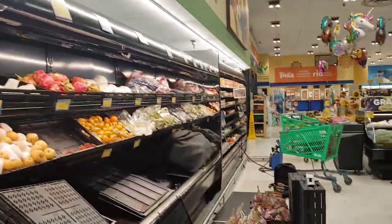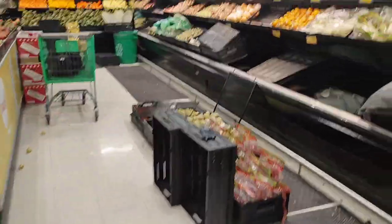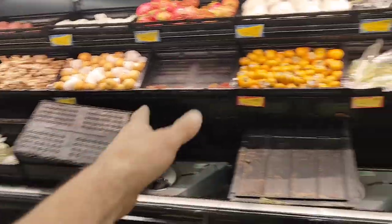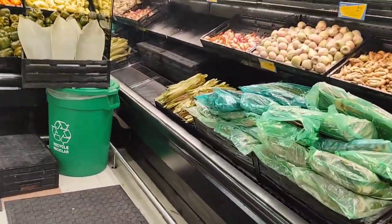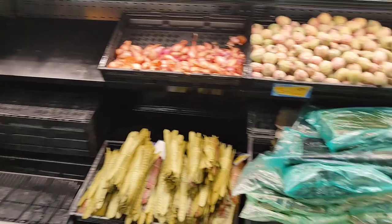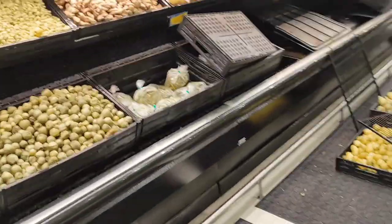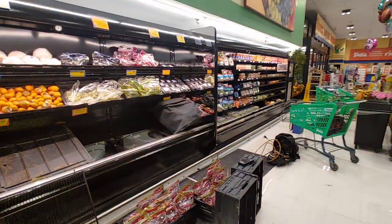Awesome. So quick recap. When I started working on this equipment, this whole side was frozen. All of this wasn't at temp, so I thought the system wasn't working. Go upstairs, up on the roof, found that it was short cycling, but that this was frozen. So I had to get rid of the ice first. Once I got rid of the ice, I quickly determined after turning it on that this system works, but these two systems did not work.